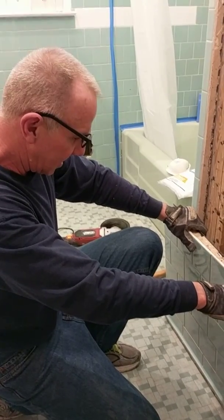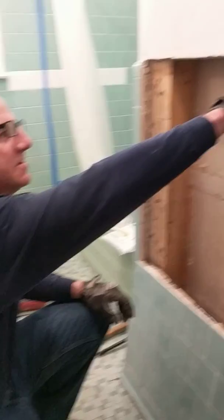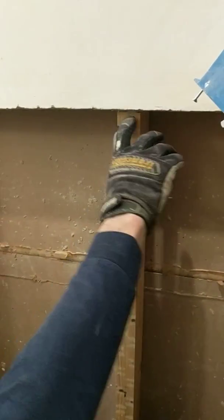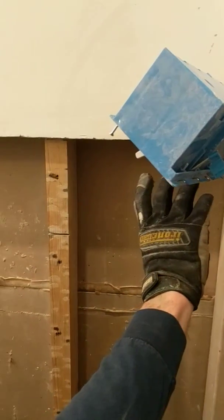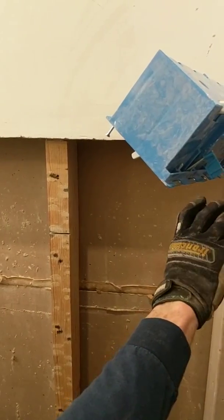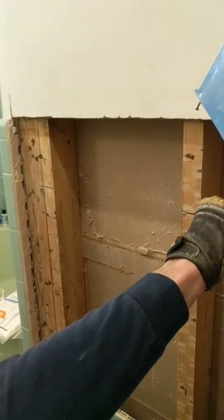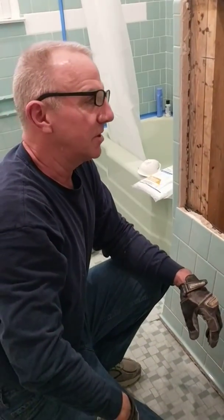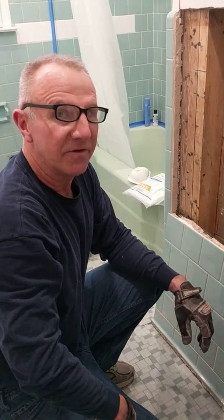It takes a little bit of practice. The hardest part is getting this first 5-inch piece out. And you'll have to do some chiseling and breaking until you do break out one piece of tile or one piece of concrete, and you can get your pry bar in there to start pulling that metal off the wall. But work slowly and it'll come right off.